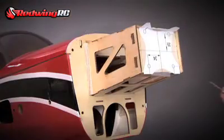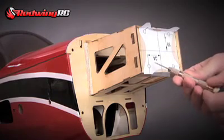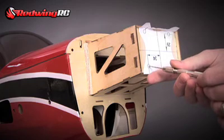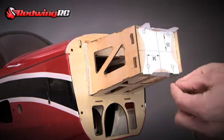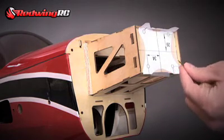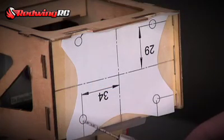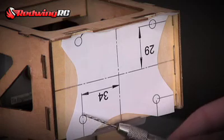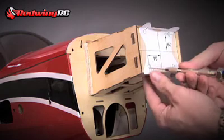What you're going to want to do is, using a fine tip drill to start with — a sixteenth of an inch, for example — drilling very specifically right in the center of the points. And then after you've done that, you'll graduate up to the next step up, and so on until you get to the proper size hole. That will ensure that your holes stay perfectly centered, whereas if you start with a larger bit you might start off-center and it's going to be off-center.